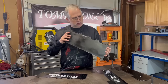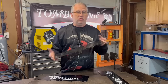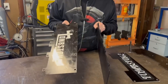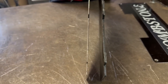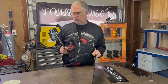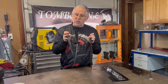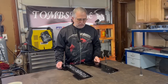One piece also cut from thick titanium is the cover that goes over the batteries — this guy right here. All it's doing is protecting the batteries; it's not part of the frame structure. So this was one where I could make a thinner replacement piece. The original is 150 thousandths of an inch, the replacement is 60 thousandths — about a third of the weight. Just changing out this one panel, I lost a pound and a half.